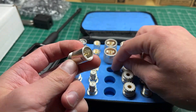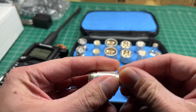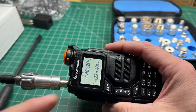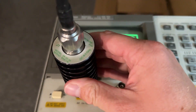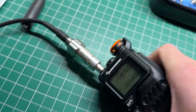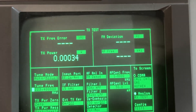You basically just take out one end, you've got a middle bit here that you screw in, and then you screw another end — whichever end that you need — onto the other, and you can make all sorts of adapters. Same test jig as before: I've just got my adapter here into my spectrum analyzer. I am running into a dummy load, not radiating anywhere, going into the spectrum analyzer, and we've got the radio set on low power. Let's transmit and see what we get.